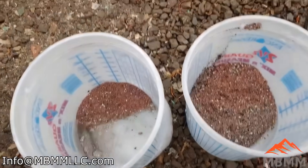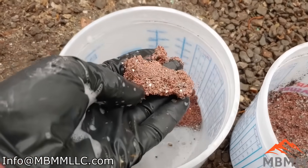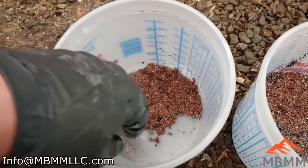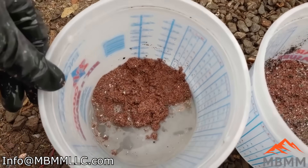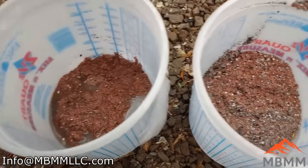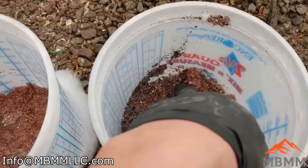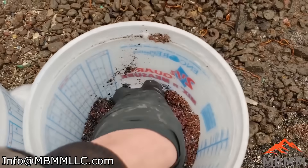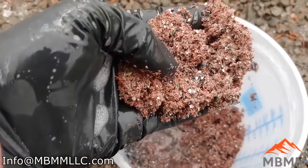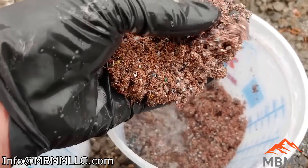Here's our screened sample number one and two. When I brush the table down I got some aluminum contamination, but you can see there's the copper. When you see it run, it's just all copper. So if you can run it all day without brushing it down, I think you can get 100% clean number two. Maybe splitting the first safety groove and the second safety groove would clean up some of that. But still the majority of this, especially by weight, is copper. A lot of that contamination came down from when I brushed it.